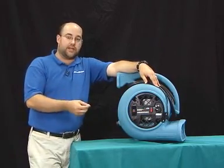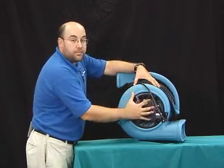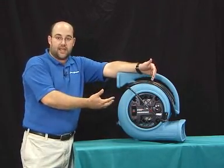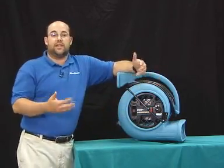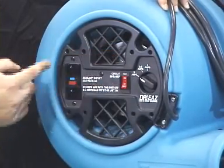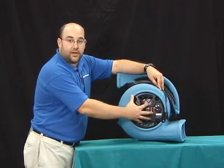Another unique feature of the Sahara Pro X3 is the motor and the squirrel cage, which is internally inside of the fan, can be completely removed from the housing so that we can decontaminate that squirrel cage, wash the motor down, and be able to simply install it right back into the unit. That is achieved really easily. If we remove the screen on the side, there will be four main bolts that actually hold the motor and the squirrel cage in place. Once those bolts have been removed, everything slides out right through the side of the air mover.